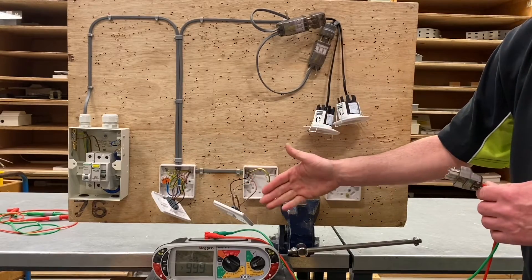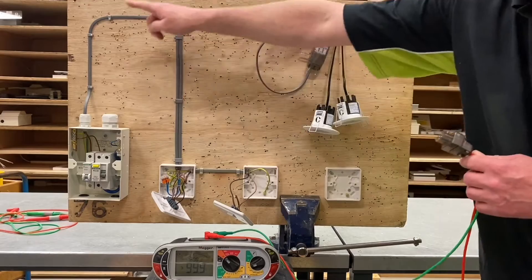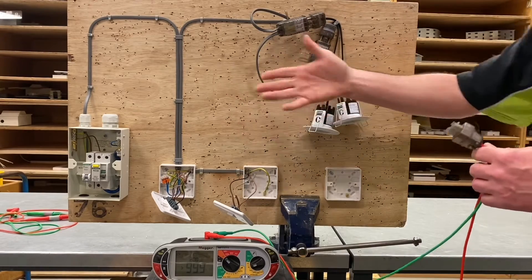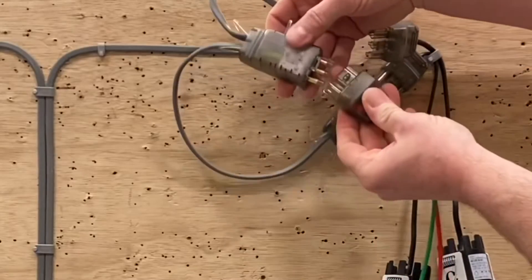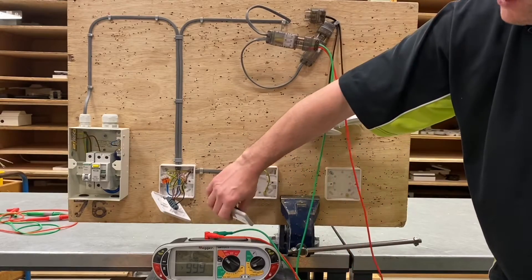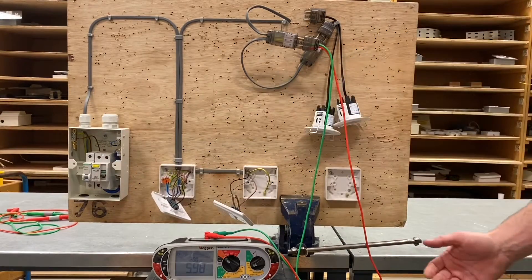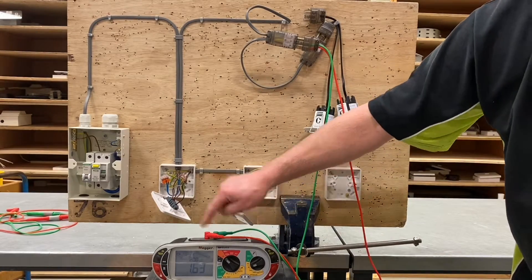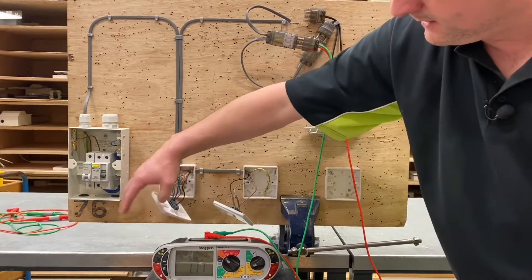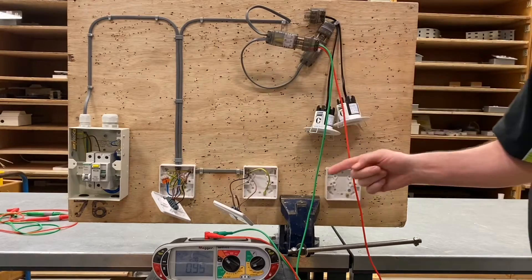With my homemade easy-fit connector adapter ready, I'm going to operate the switches to prove polarity and record the highest reading at each lighting point. We expect it to be higher than at the switches because the cable went down to the switch, through the switching sequence, and back — so the highest reading should be at the lighting points. At the first point I clip in the adapter and get no reading at all, suggesting the switches are in the off position. Operating the first switch, the circuit comes on: 1.28 ohms. Operating the second switch gives a slightly higher reading.